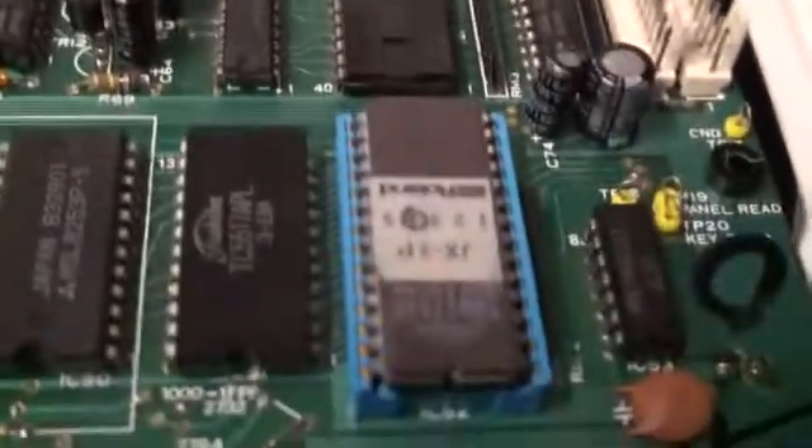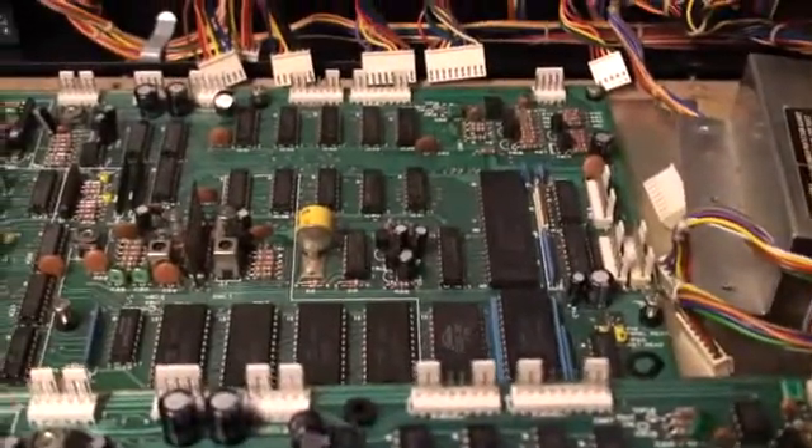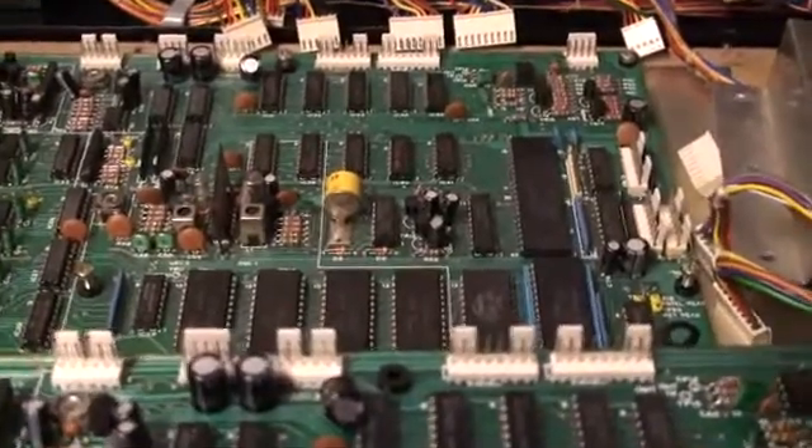In the event that it is a CPU problem, I know I have a good CPU and good firmware here, and those are going to be basically replaced by the 3P kit. So I can take the good stuff and put it in this other board, and maybe that will bring this one into somewhat more of an operational condition. Anyhow, it's worth a try — so let's get going.